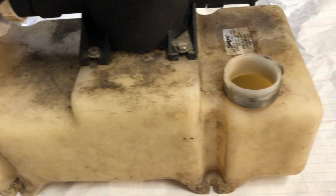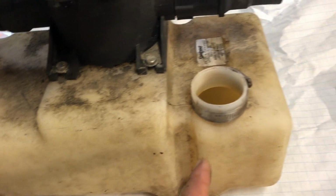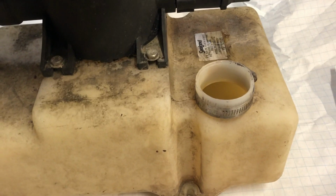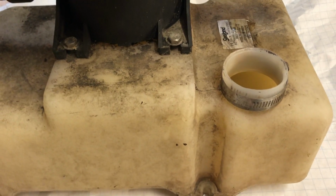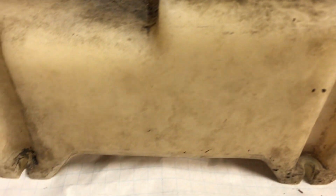When you step on the pedal on the toilet in the boat, it sucks all that crap into this pipe here, along with a big slug of water. Not a big slug, like a pint or something like that. So at any rate, it draws everything from the toilet. So it can suck it uphill, it can suck it around corners, it can do whatever. And then what you end up with is poop sitting in this thing.